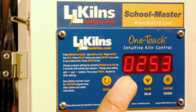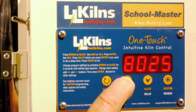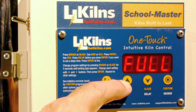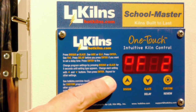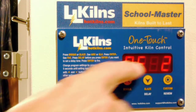I want this to go as fast as this kiln can take it. So I'm going to hold this button down and bring this up to 9999, which is as fast as the program control will tell the kiln to go. The kiln won't go that fast, but it'll go at its maximum rate. In degrees F, set point number two is going to be 1500 degrees.